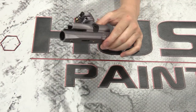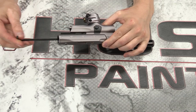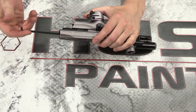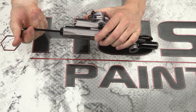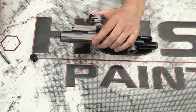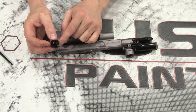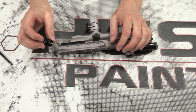To remove the valve we need to take everything out of the lower tube, starting with the IVG — internal velocity governor. My advice is whenever you're removing the IVG or the hammer, count how many rotations out it is; this will make putting your gun back together much easier. About five, maybe five and a half turns. I like this IVG because it has quite a few lines of threads — a traditional IVG only has maybe two or three. It'll be much smoother and won't bind up. It's also milled out and very lightweight.